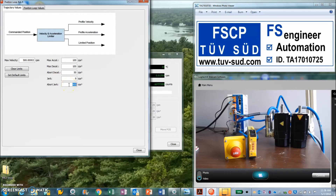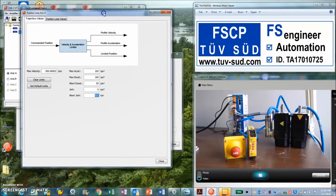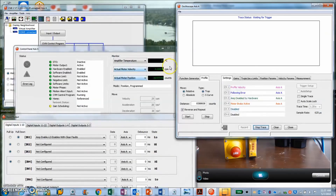Just don't set the abort jerk too small, because then you'll never be able to stop before the brake is turned on. On the relay, the immediate contactor will be connected to an input such as Input 1. When I hit the stop, it will immediately hardware-disable the drive before the STO is cut. To simulate that, I'll click on the Input/Output screen and look at Input 1, which is active-low enable. When it goes high, the drive disables. I've got the scope trigger set up on amp-disabled-by-hardware to capture the sequence of events.